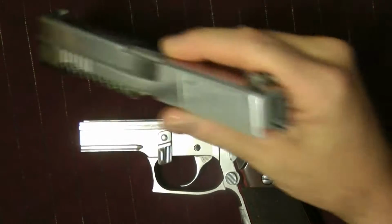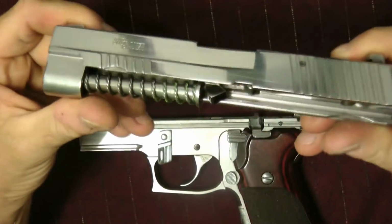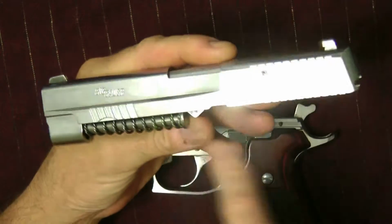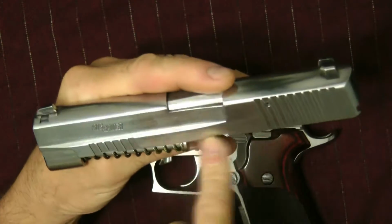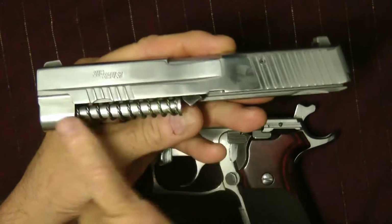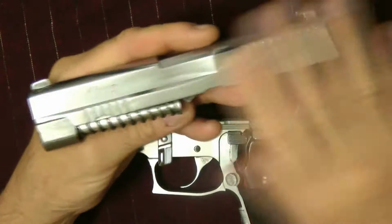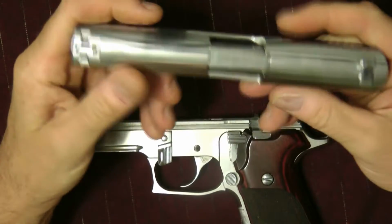let me wipe it down a little here, because I got a little fingerprints. Did you see how shiny I got that? Well, there's still a little here. If you want to get all the scratches out of it, you have to sand this down, so like some 400 or 500 sandpaper. Sand this whole thing down, and then I buff it out.